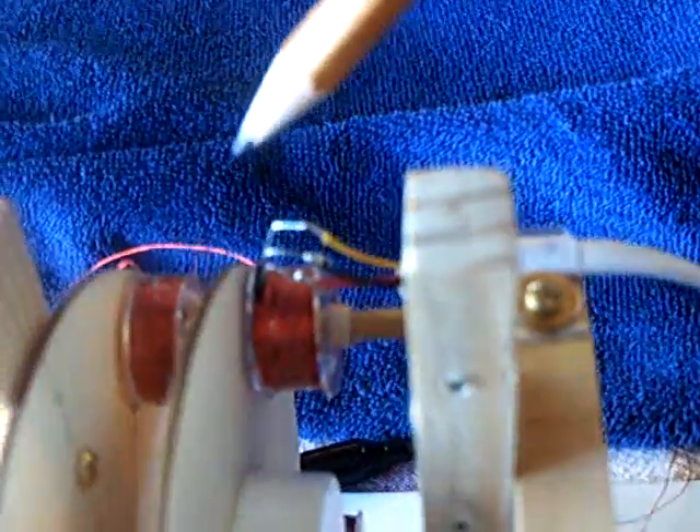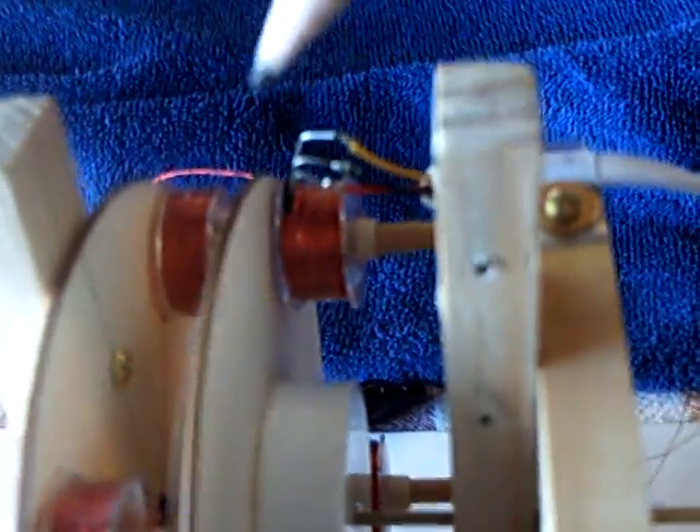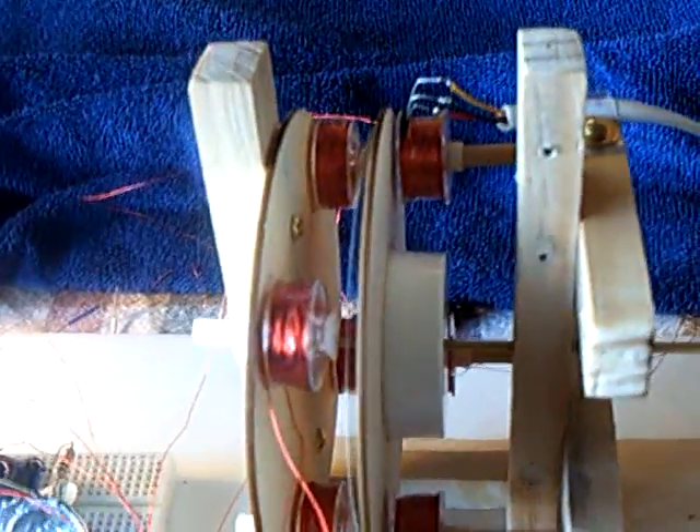It's very easy to do and very critical for your amp draw. By doing this, I got the amp draw down on this under 10 milliamps. And last night I ran this for an hour on a super cap and it ran quite nicely.